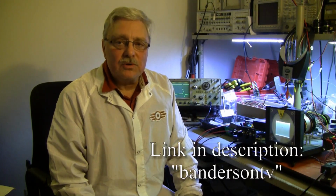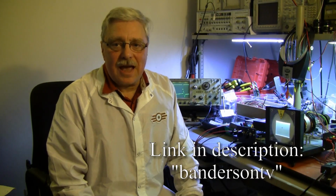5AXP4, which was a serviceman's test CRT from the 1960s. The way this worked is a serviceman might come to your house and you have a 21-inch black and white television in a console, a huge monster. Rather than lug the entire console back to the shop, he would pull out the television chassis, leaving your CRT behind and the cabinet, and he would take the chassis to the shop and he would stick the 5AXP4 into this chassis. A simple search on YouTube will turn up a video where a fellow does exactly that. Search for 5AXP4 and you'll find several videos about it. Some of them are mine.